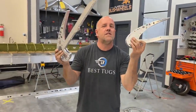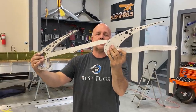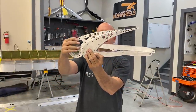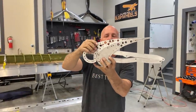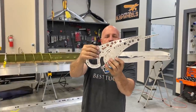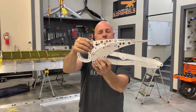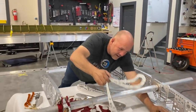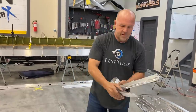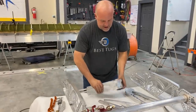All right, so these two slats, I didn't want a big bracket hanging under the wings, so these actually pass through each other and then reshape so the front of the wing is small and flat. When it goes into slow flight mode, it reshifts and droops and then moves out. So something like that. These right here are the receivers that capture the carbon fiber slats. So these will get attached like that.